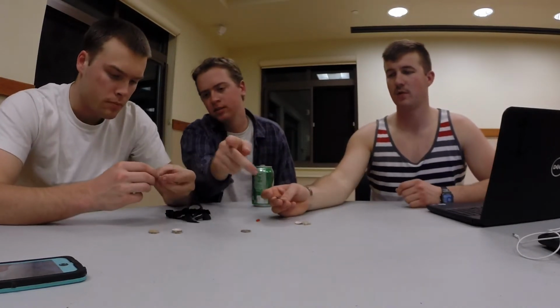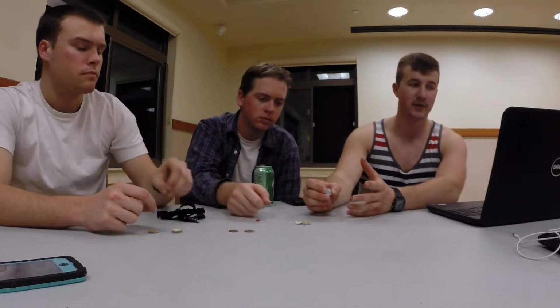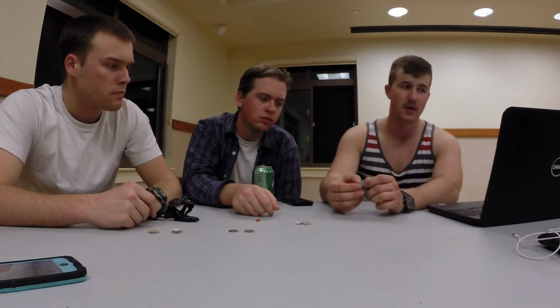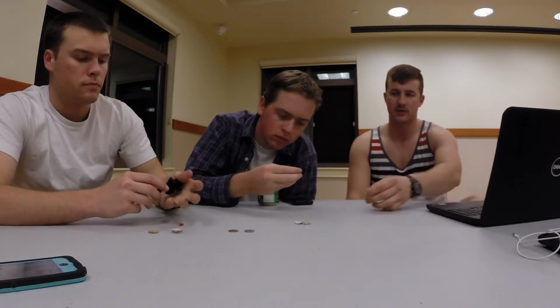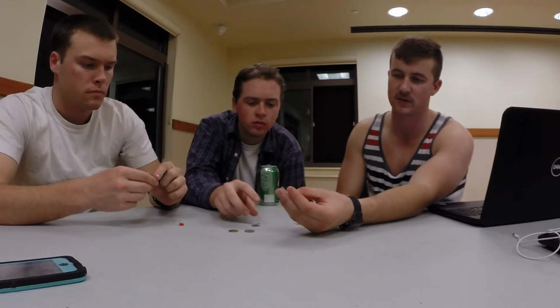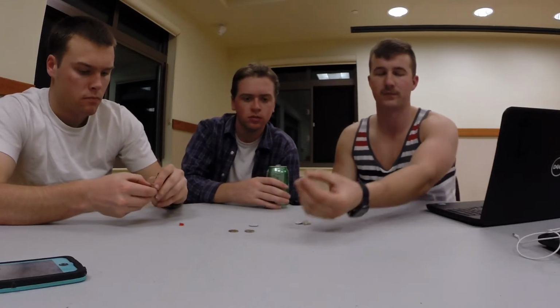So what we have here, the product of this plating or this redox reaction, this is called our redox couple. And so, a redox is the loss of electrons is oxidation, and the gain of electrons is reduction. And so here, this byproduct that we have from this chemical reaction that was going on between our electrode and our electrolyte, that formed a redox couple.